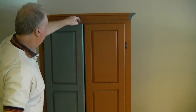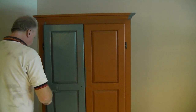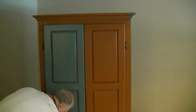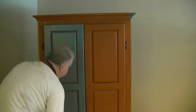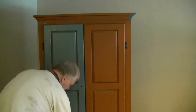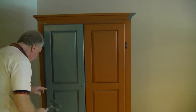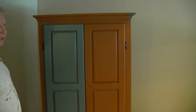When we finish this off, we start from the top and work our way all the way through, gently bringing it all the way down. Then we just want to make sure we haven't caught the edges — with our roller there should be no heavy deposits that are going to run or sag on us. So that door is complete. We do the same on the other door and we'll be ready for frames.